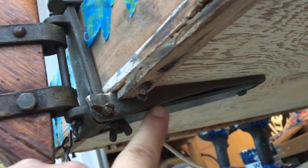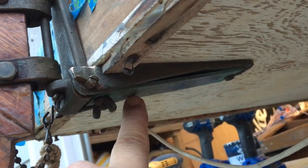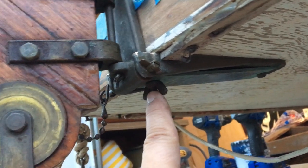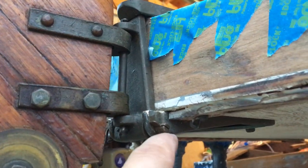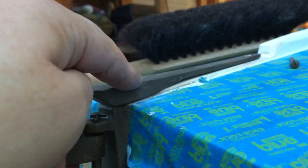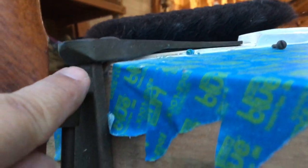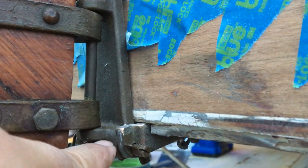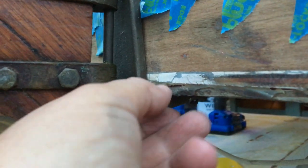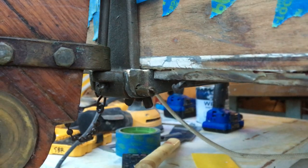There are several components: there's a deck plate up here which has a little spring plate — spring plate and deck plate attached there. There's a little wedge right there that this spring plate — just think diving board — is here, with a carriage bolt that goes actually inside the boat through the transom, up to the top here. You've got this keel plate on the bottom here, or latch plate; it's attached with the screw forward, and then this vertical plate on the rudder here hinges on the pin.